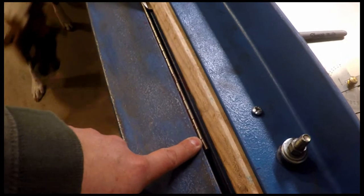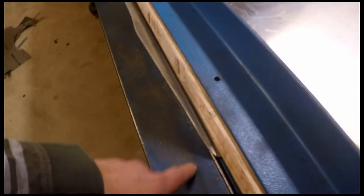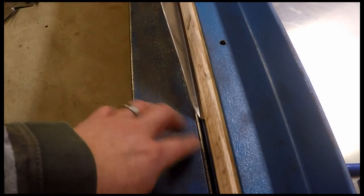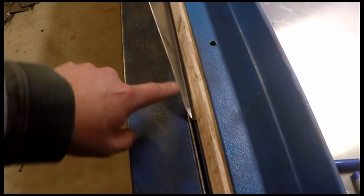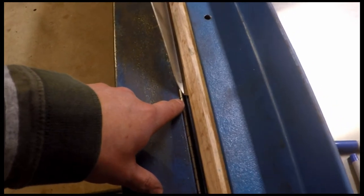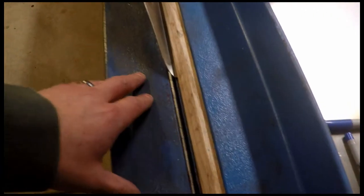Those will be substantially stronger, and I'm going to give it one other shot, and hopefully I can finish bending this material. This is one of the longest bends you have to make. There's probably half a dozen parts in the airplane made out of 63/1000ths that have around a 1,000 to 1,100 millimeter length in them, where this is only about 850. So if I can get this bent successfully and it doesn't look like it's going to damage the hinge and put in too much strain or break the hinge, I may go ahead and try to bend some of those longer parts. But as the brake is built currently, it's just too much.